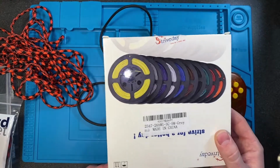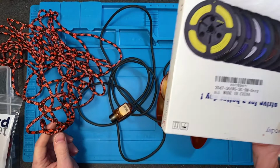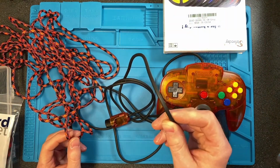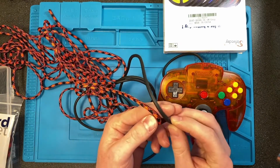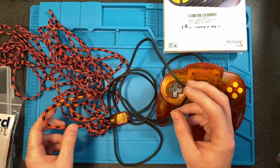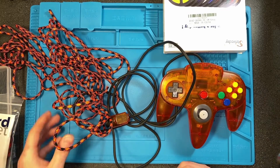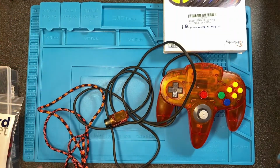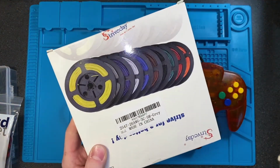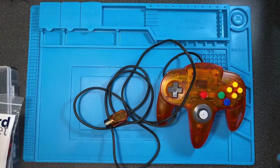It was very difficult to find wire that fits inside of 550 paracord. A lot of it is too thick. The thickness of this original wire is about the same thickness as 550 paracord itself, so this will never fit inside of it. I felt like if I went with a bigger paracord, it would have made the cable way too thick if I wanted to reuse any other wire. So definitely take your time and try to find out what wire will fit inside of the 550 paracord.